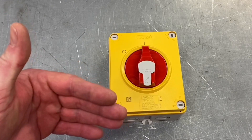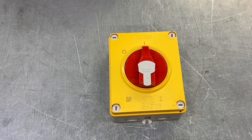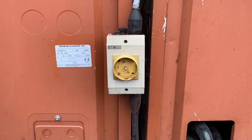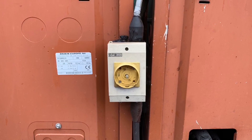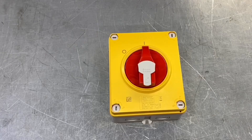A very clever thing about the black and gray non-emergency version is that it can be locked in the on position, whereas this emergency version is locked off. That might seem odd, but if you think about a large hotel, there's always the risk that someone might come along and switch that isolator off who shouldn't be — low-level vandalism. In that situation you might want to lock it in the on position so that nobody can tamper with it.